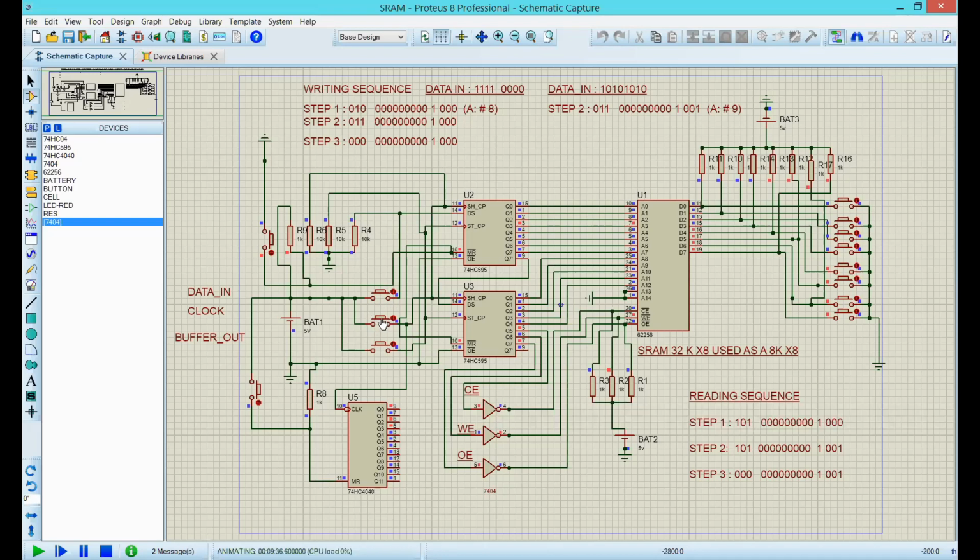Zeros, because I'm going to be reading memory number 8, actually, sorry, memory number 9. So that means that I need to put a 1 here at the end. There we go, bit 16, excellent. Now, all this is in the off state, will not bother, so let's see. Perfect, that's what I have in memory number 9, nothing. Nothing, because I haven't written anything into it.